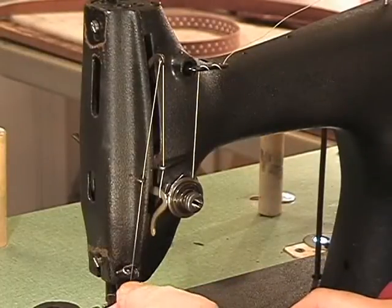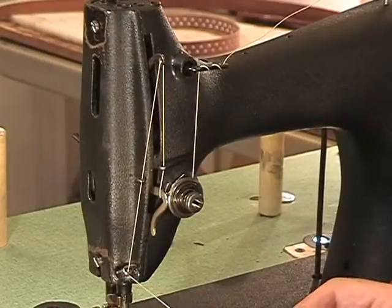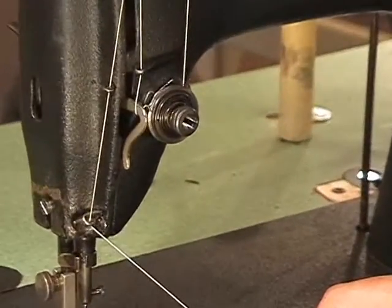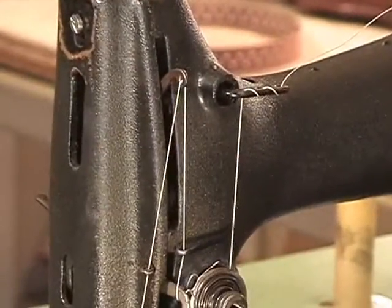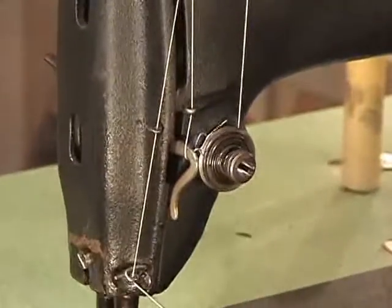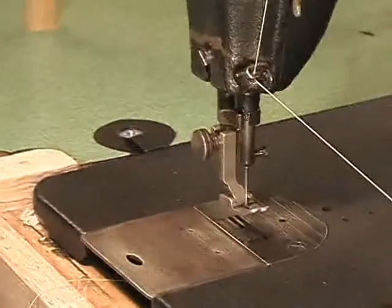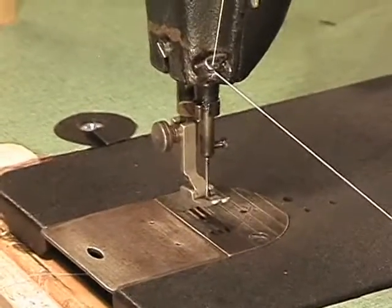Okay, it's tight. Then there's a looper down here, which is just on the bottom of the shot, and back through. Let's tilt down just a little bit, and there it is. You can even zoom in on it. These two guys right here, just like that. There you go. Coming through the unwinder, through there, up to the top, down on that one, that one, that one, that one, that one, that one, and down to here. And then we can set this shot up for catching the bobbin thread, just like that.